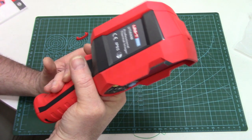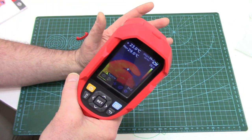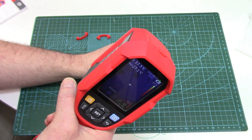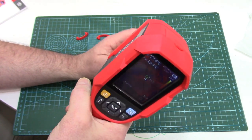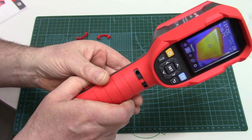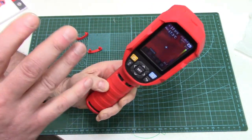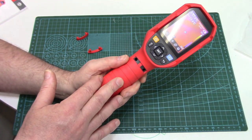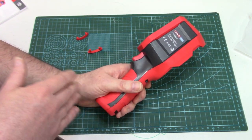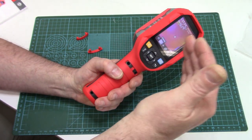That's the Uni-T UTI 690B thermal imaging camera — I'm really impressed with it. I've been using it for almost two weeks and it's been able to measure and image everything I was hoping it could do and even more. I had no idea I'd be able to see studs in the wall so well, and picking up the dog's footprints — I still can't believe that. My biggest concern is if the lithium cell ever dies — how do you change it? I found you can remove two covers on the back of the grip to access four Phillips screws, but I don't foresee that being an issue if you follow standard lithium battery care: don't store it fully charged or fully depleted, keep it somewhere in the mid charge level.